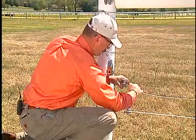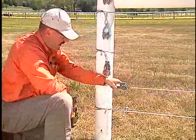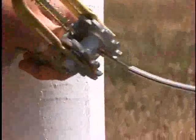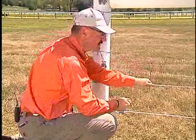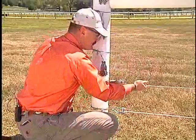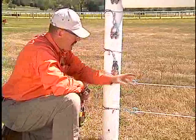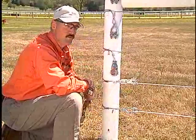Give it a little bend, run it around a few times — each time kind of giving it a little bend. If you kind of get it there, there's not that much tension at this point. Then utilizing your handle itself, start working it on up — nice and tight. Now all the slack has been removed and you're up to the tension at this point. You'll come back later on and work after you've got all your individual strands up and set your tension on each one of them at that point.